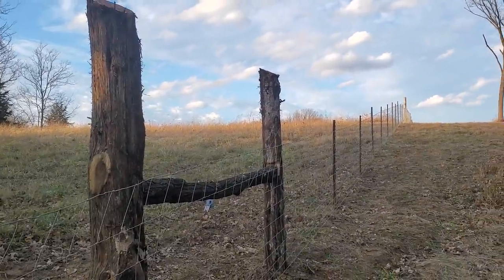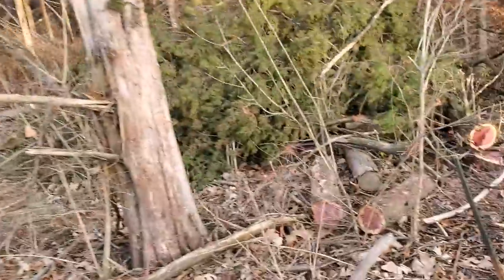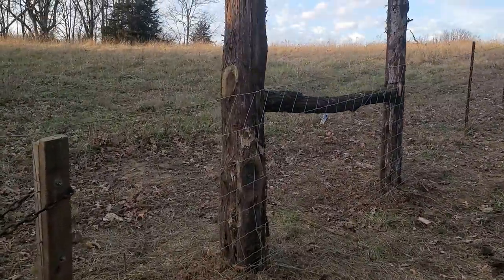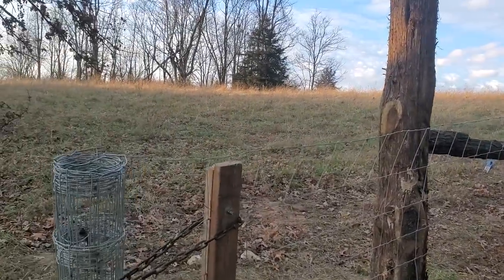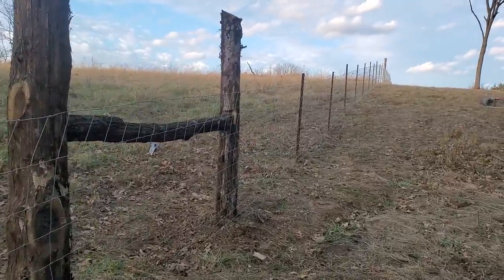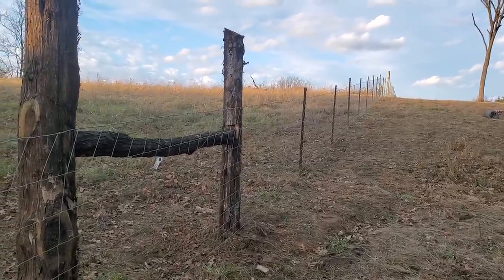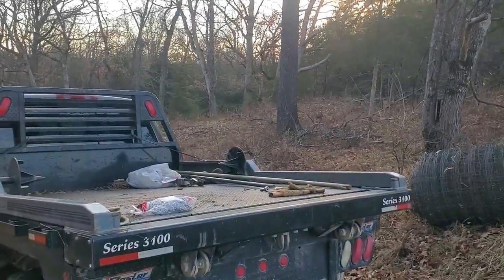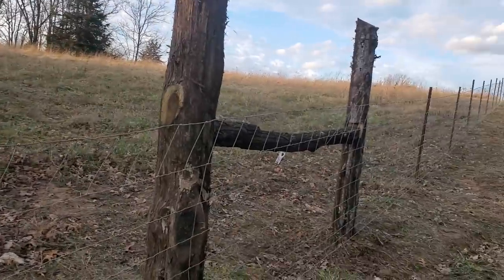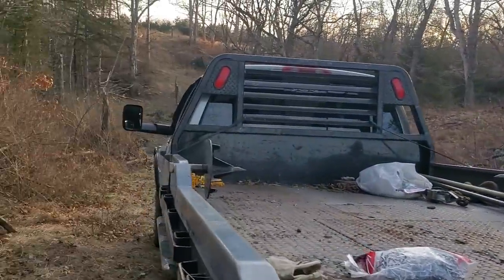These are massive corners — they had these things cut 14 foot long, and I cut them down. That's how much I cut off right there — four foot. So now they're 10 foot long instead of 14. You don't need 14-foot corners, not when you're building a 50-inch fence. That wire is just 47 inches; you put the barb on top. We're using the posts that we had stored up and they're still good.